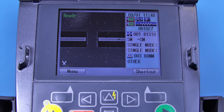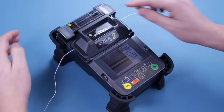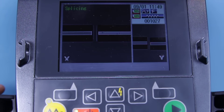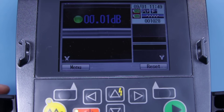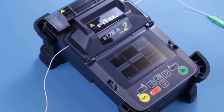This is your chance to make sure your cleaves are neat and clean. If your fibres are positioned too far from the electrodes, then an image will not show on the screen for that fibre. If either fibre tip crosses the electrode, then an error message will appear. If you are happy with your cleaves, then press the green button. You will hear a beep and this will start the splice process. The fusion splicer will line up the cores of the fibre to join them together and do a quick automatic pre-clean of the fibres to blow away any dust residue before it begins the actual splice. It will also report any errors if it cannot perform the splice.